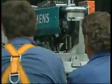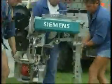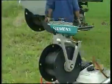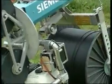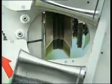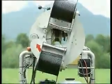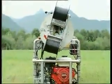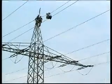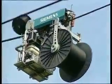The machine consists of a spinner with two rolls of lashing tape and a cable drum that can hold up to two kilometers of cable. Combined with the trolley and a four-stroke engine, they form a unit which can be used to lay cable via remote control. The cable drum is situated below the lashing machine. The cable, which is subjected to a slight amount of pressure to keep it taut, is unreeled.